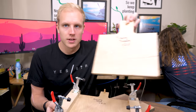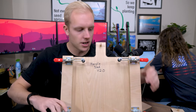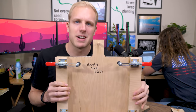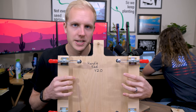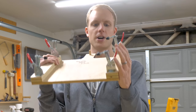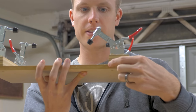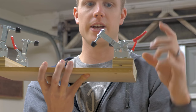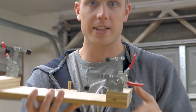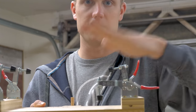Here's the jig and the tracing template. The tracing template is just a little bit wider than the handle. Then we put it on this jig, indexed again with the dowel. We clamp the board down with these toggle clamps, which are up on these pieces of plywood so they're up off the bottom. Theoretically, we have a limit to the size of charcuterie board we can make, which is about 10 or 11 inches. The toggle clamps do a really good job of holding down the workpiece — we didn't even need to put the adhesive backed sandpaper on this jig. Because of how the toggle clamps work, this pushes down but hinges between the plywood layers, so the strength of the glue bond and the plywood layers is what gives it strength. To counteract that, we've drilled screws to the bottom tying everything together, so we won't ever have to worry about how tight this toggle clamp is pushing down.